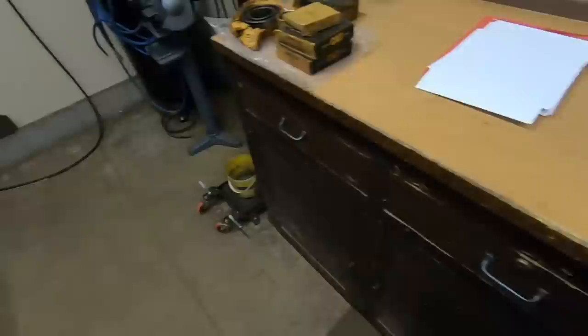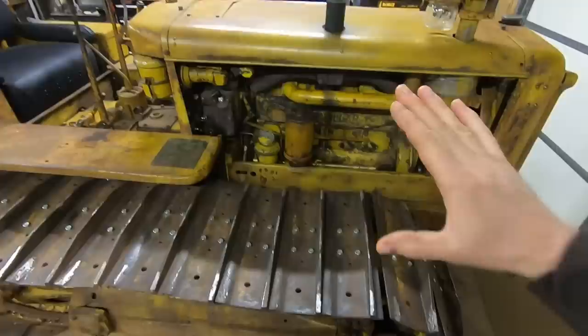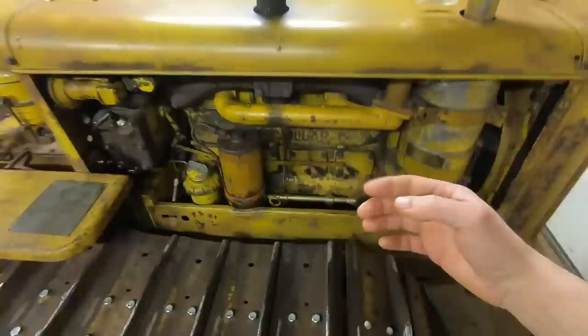Page one of the breakdown. I categorize this according to build stage increments, same as I did with the Farmall Super M. We're starting with a diesel engine short block, or rotating assembly — an engine block without a cylinder head, no front cover, no flywheel, no bell housing, no oil pan, no oil pump. Just an engine block with a crankshaft, liners, pistons, rings, and rods. We spend a lot of money in a hurry right here.